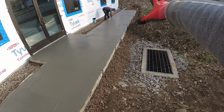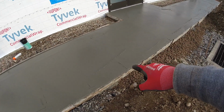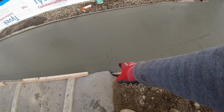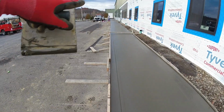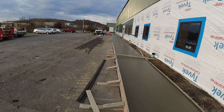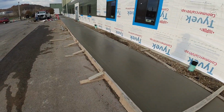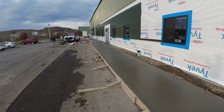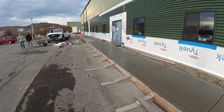So the second truck is setting up pretty good. Stan's edging it. He's going to bring the regular 6-inch edger over to our last cut at the curb line, and we'll pick up our curb border right at the curb line and continue it down. I started on cuts on first truck. Second truck's just a little bit wet. I could probably get that front porch area, front entranceway area cut.